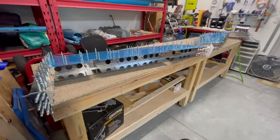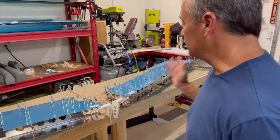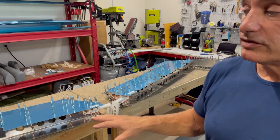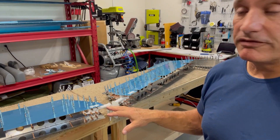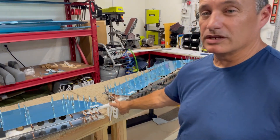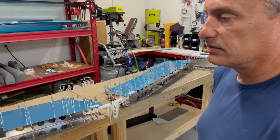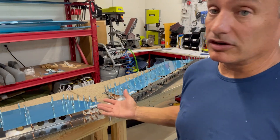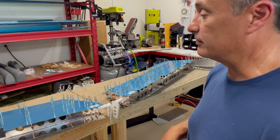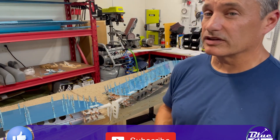I'll pick back up in the next video after all that fun stuff is over and begin the final assembly. About the first third of the elevator assembly is complete. Any holes that needed to be match drilled have been done. The vast majority was already final punched by Vans so the skins didn't need much match drilling — there was a little bit on the tips, and the holes for the elevator horns. The next step is to take it all back apart for dimpling, prepping for priming, and then final reassembly to rivet everything together. Making good progress — about a third of the way done, so this is probably the first of three videos, maybe two.